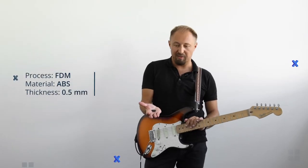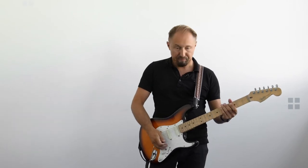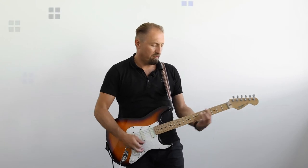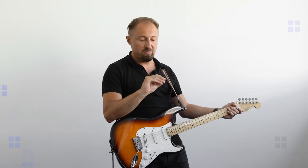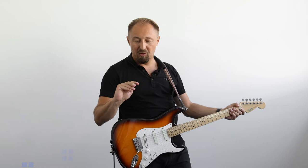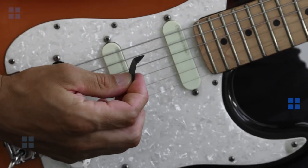The last thickness, 0.5 mm — FDM again in ABS. At 0.5 mm it's still flexible. The FDM one has a small crack mark — a mark finally. So it will not survive a song I guess. You can see this one is really borderline at 0.5 mm.